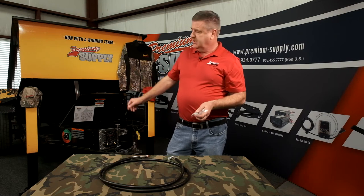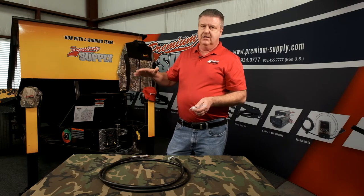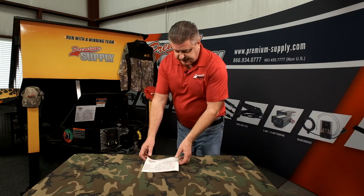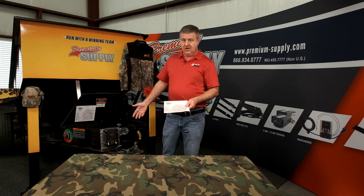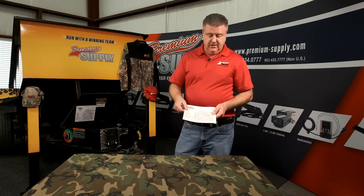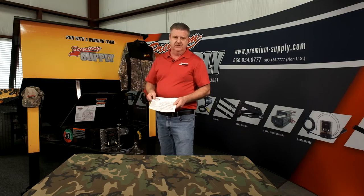We have one fitting that goes on all of our standard hydraulic kits — at least if it's a dump. It goes on the bottom port so if the dump is in the up position and a hose fails, it comes down at a very controlled speed, giving the person more time to get out from underneath the trailer. We're constantly talking about downtime and battery life. One thing we developed is a troubleshooting sticker the customer can put on the inside of their toolbox so when they're in the field and start having problems with their pump, they can look through it for short ideas on how to repair it and get going again. We also highly recommend — noted here in red — to never high pressure wash your toolbox. These pump motors are not designed to be waterproof, and if we ever see a pump with rust in it we'll know that's been done, and that does void the warranty.